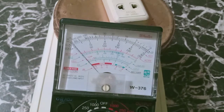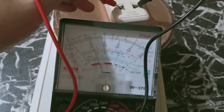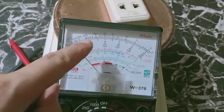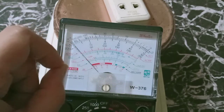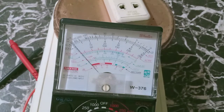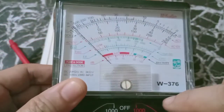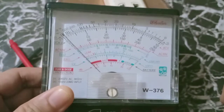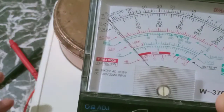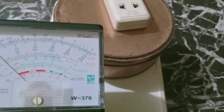Let us try to set this into 1,000. So the reading is 220 — it could be 225. But as I have mentioned, since the graduation is very little, maybe we could not read the 5 volts. But in the 250 setting, we can read it more accurately since the setting is smaller — 250 is smaller than 1,000. So I hope this exercise helped you on how to read the multitester using an actual battery for direct current and our outlet for alternating current. See you next time. Bye.